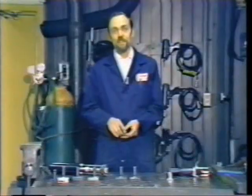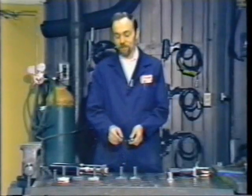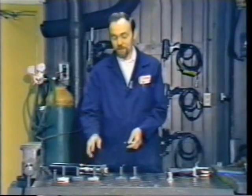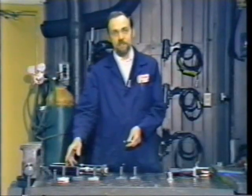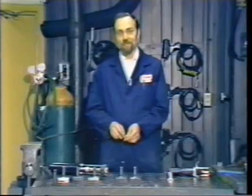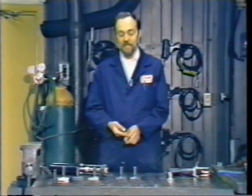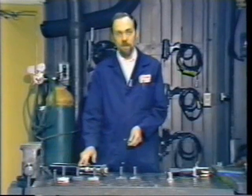The next topic is inspection of the welds after they're in place on the base material — specifically looking at features of the weld fillet that will identify problems between good welds and welds that were too hot, too cold, and ones that didn't have enough plunge or had a mechanical problem in the gun itself. By examining the weld fillets closely, we can get clues from the fillet development that will indicate a change needed in the setup: the time, the amperage, lift, plunge, or the tranquil arc and dampening in the gun.